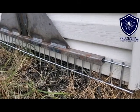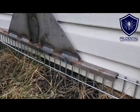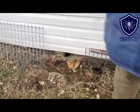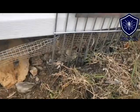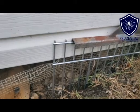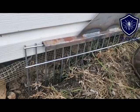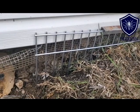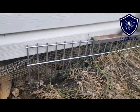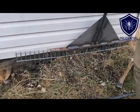We're seating it home here. As we get closer to the main opening, what the homeowner can do — because groundhogs over the years had excavated quite a bit of soil — is just throw some topsoil back into that opening once the Dig Defense is in, and it'll look flush with everything else. They can put grass or whatever they want right along the shed. We can see already how much deeper this is going than the original exclusion, which wasn't working.